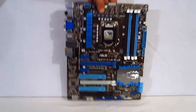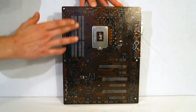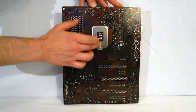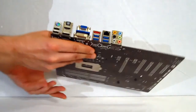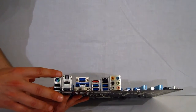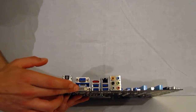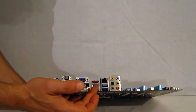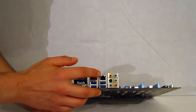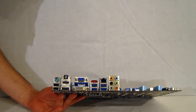Moving over to the back, we see a very well put together board — very nice soldering throughout, nicely laid out, nothing rough to it whatsoever. Nicely finished, good backplate on the rear. Moving over to the rear I/O: two USB 2s and a PS/2 — as I say, bridge board, you don't need to get rid of all your old components if you're doing a step-up, so the PS/2 is included. HDMI and DisplayPort, as well as an optical output. DVI and VGA. A total of four USB 3.0s — two run by the Intel chip and two run by the ASMedia chip. eSATA. Realtek Gigabit LAN, as we saw on the chip. And 7.1 channel audio supplied by a Realtek ALC889.